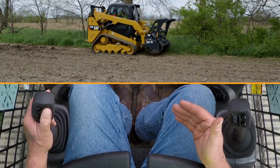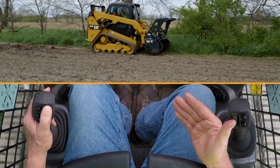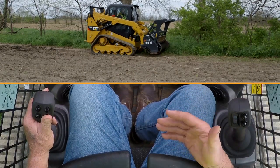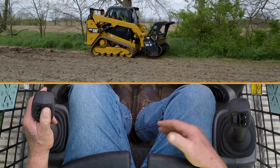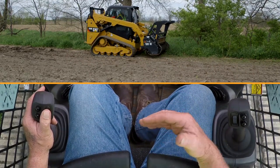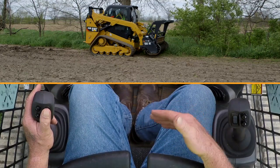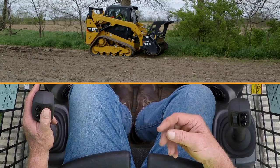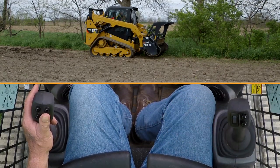Now in continuous flow, the left joystick operates the door on the front of the mulcher. The purpose of that door — operate it open, as I'm doing right now, fully open — is to cut down vegetation and trees up to eight inches. After things are felled and on the ground, you can close the door, which runs the felled product through a set of knives inside the mulcher, chewing it into fine mulch and returning it to the soil.